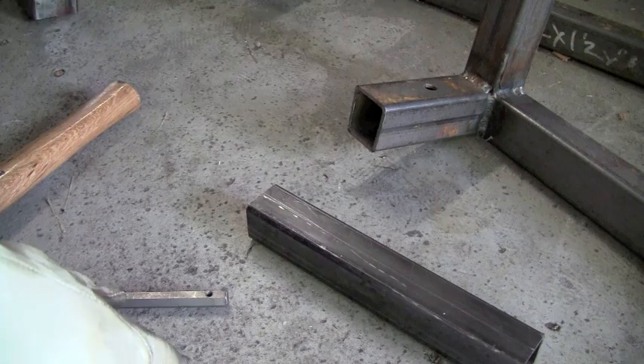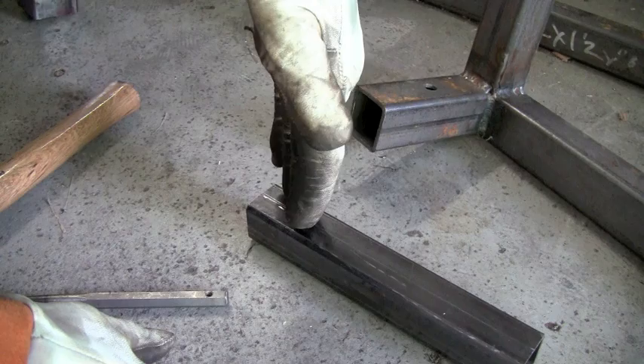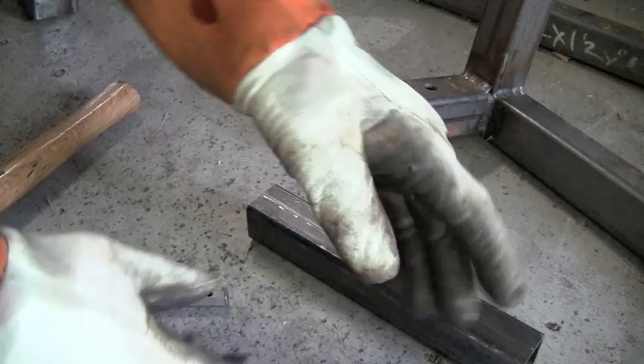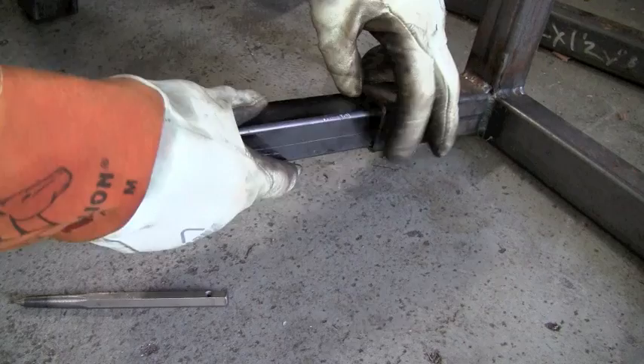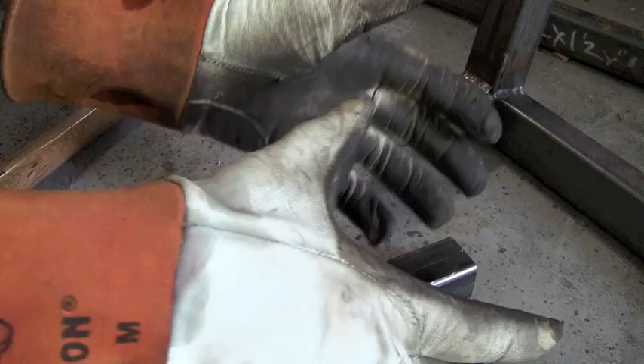Try to keep it real nice and straight. Then you're going to take the grinding disc — the grinding disc runs this way — and then you're going to walk it on an angle like that, not in the groove. You're going to hold it so it takes that groove and flares the edges, so it'll have some freedom to move inside there. It won't move too much because it's a tight fit, but it opens it up.